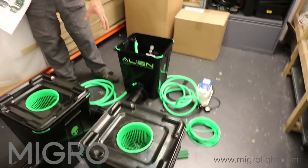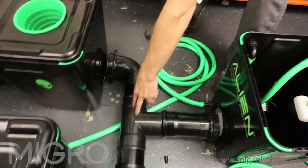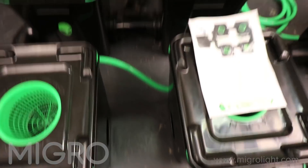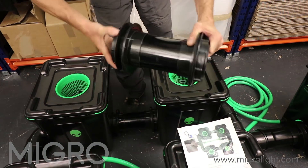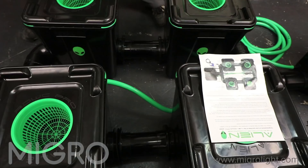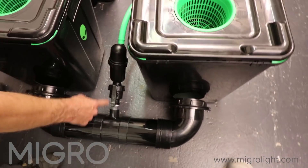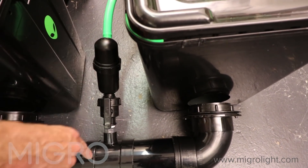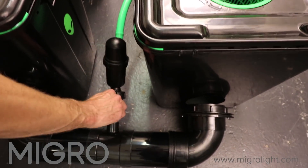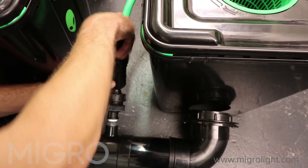That pulls the flow wave through the four-inch pipes through the two sets of tanks and back through the middle. From our feed tank the water flows through the four-inch pipe and through the T, then through these two sets of tanks. The pipes join together and a suction pipe pulls the liquid back to the mix tank. You can isolate the filter so that if you need to change it you can do so without emptying the system.